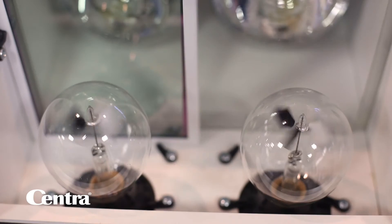We also have an upgrade to what we call our extreme performance glass, which is three coats of low-E. We have a second upgrade called our I89 — the I stands for indium. It is an indoor low-E that helps reflect even more heat back into your house in the winter. With the I89, it is the equivalent of a triple-glazed window, still in a double pane, and that extra heat reflection will truly reduce your heating bills.